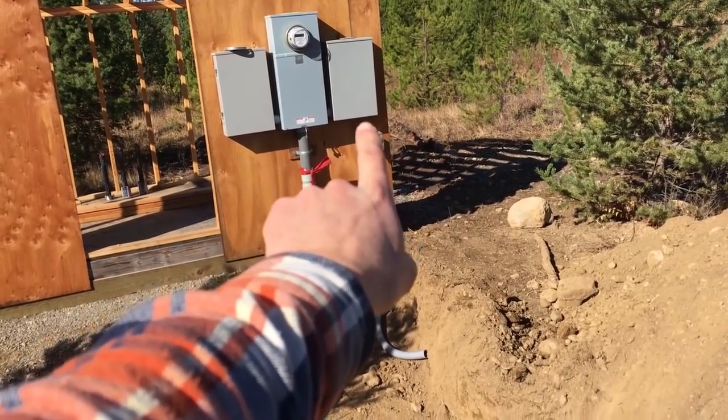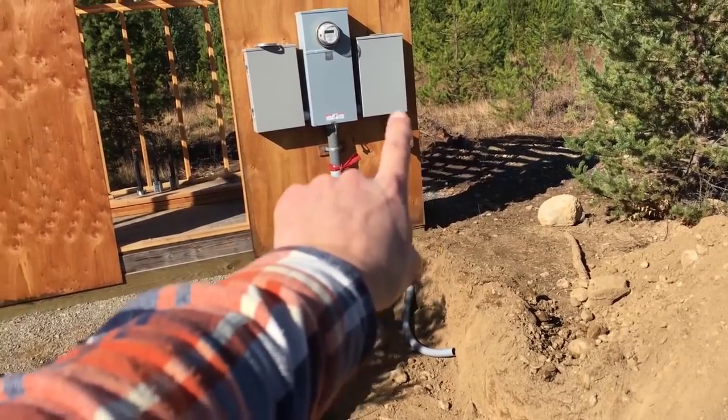This actually helped make the decision on where we placed our home on our previous property. The transformer was on one corner of the property. We were initially planning on putting our house almost at the opposite corner, so it would have cost a fortune to bring in power all that way. We ended up just needing to trim things down and make a simple straight driveway toward the back of the property from where that transformer was, bring in a short underground power line from that junction box to our pump house, and then distribute power from there.